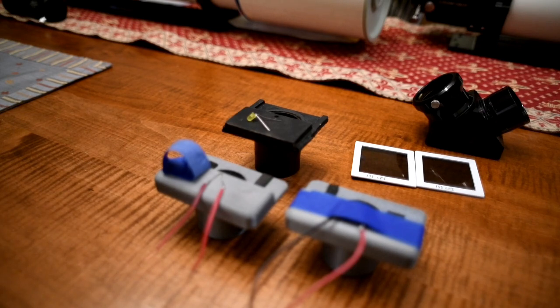So if somebody wanted to be plentiful and cheap. Yes, so if somebody wanted to use the setup we saw previously, make sure they're getting 3 volts and not 10 volts, so that they've got the proper power source for the LED. But they're so inexpensive. Get a combination of voltages. They come sometimes in big packages. For $5, you might get 20 LEDs. Oh. So of different sizes and different colors and different powers. That way you can mix and match and experiment to find what's best for you. Excellent, excellent.